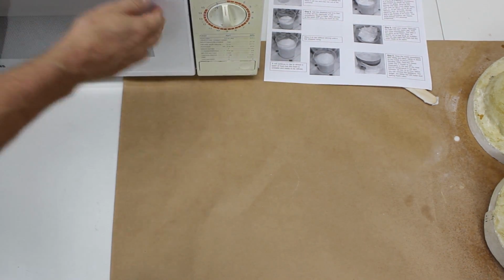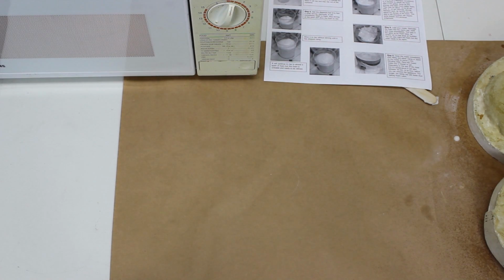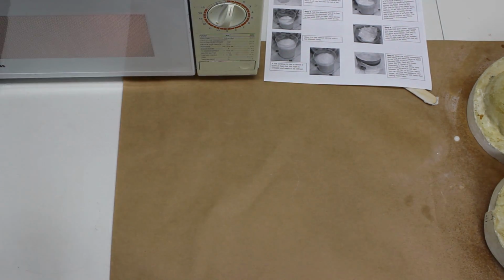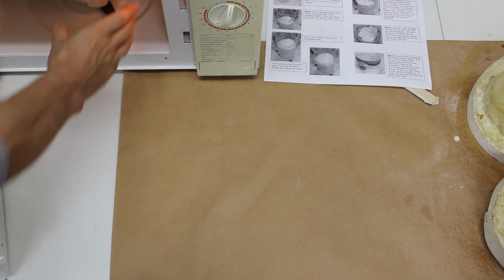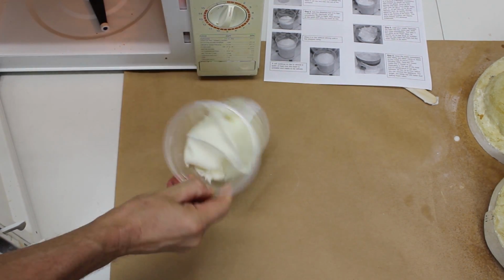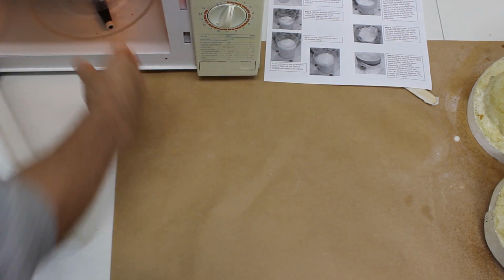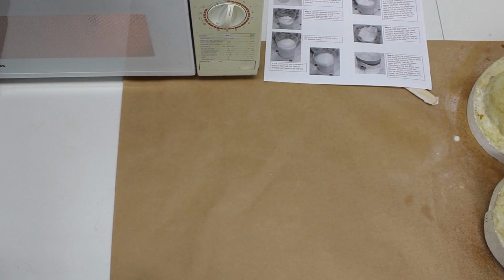Then, place the appliance back into the cup with the rest of the extra material and reheat the gelatin in 10-second intervals again. Reheat it slowly. You don't want to boil the material, as this will destroy the collagen and add unwanted bubbles. Repeat this process as often as necessary until the gelatin is completely melted.